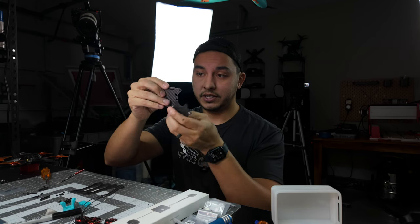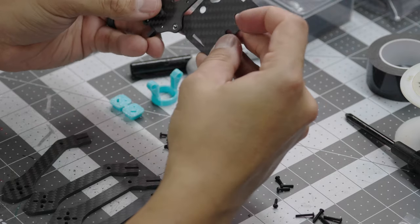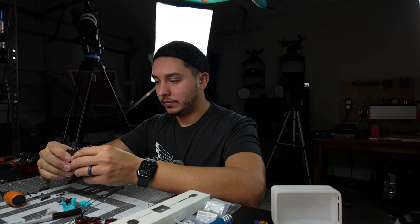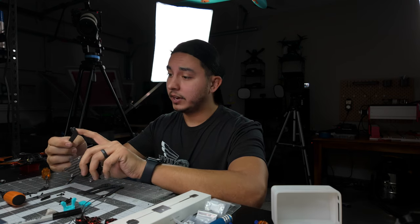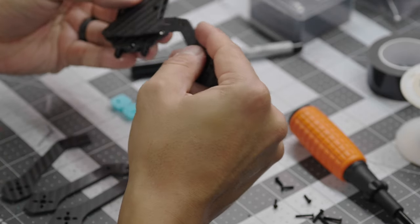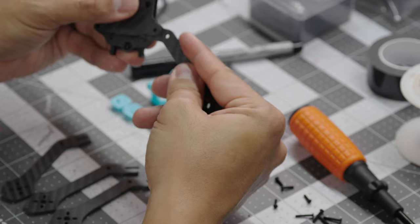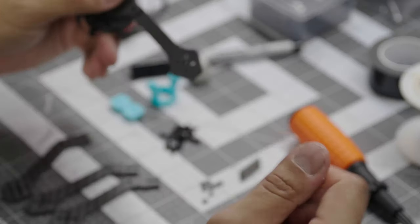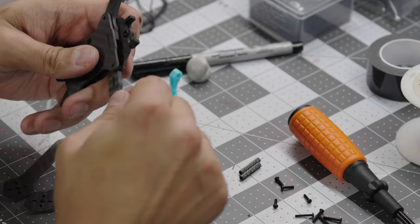Once you've enlarged that hole it should assemble pretty easily. The bottom plate — you want to make sure that these slotted oval holes line up with the rear mounting holes for your DJI O3 air unit. You have two holes there; that's what the access holes on the bottom are for. Once we've got that installed the next step is to get your arms. You can see there's a slot right down the middle that's going to hug that vertical piece we just installed. If you have a vertical piece that's a little thick, you can almost open up that little tuning fork end and just slide it on.